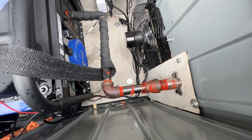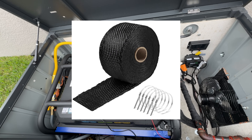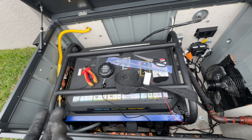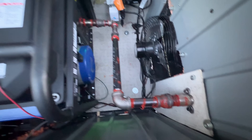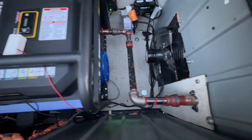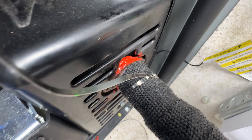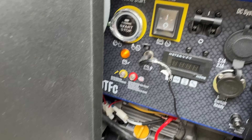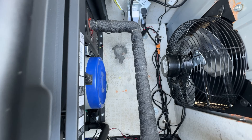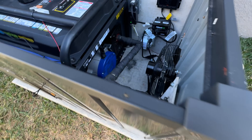In addition to the exhaust fan, I run a pipe from the generator exhaust to an exhaust silencer, which functions like a muffler. As you can see, I'm currently wrapping it with a fiberglass exhaust wrap because this pipe gets extremely hot. Initially I didn't think it would be an issue since the pipe is inside the enclosure, but I learned the hard way when I accidentally touched it while the generator was running — it wasn't pleasant. I used black iron pipe because I had some left over from another project; otherwise I would have used galvanized steel, mainly to avoid corrosion. I encountered some difficulties connecting the pipe because the surface for attaching the exhaust adapter didn't sit flat, so I had to use a silicon gasket to seal the connection. This is crucial because this generator has a built-in carbon monoxide sensor that shuts off the unit if it detects carbon monoxide. Since the exhaust fan is set to turn on at 95 degrees, the fan will not activate in time to clear the enclosure. For now, the silicon gasket seems to be holding up — time will tell.